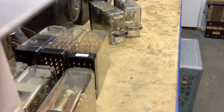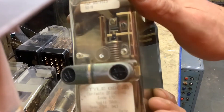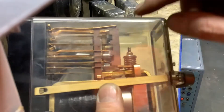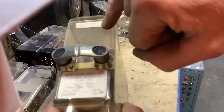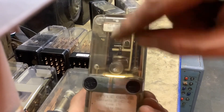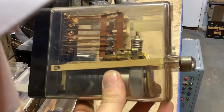Here is the motor drive relay. This is designed to switch high current when driving point motors, and when you stop driving the point motor, the spinning motor becomes a generator producing back EMF. The drive contacts are separated by a lot of plastic — you can see the separators between the two sets of contacts — because both the positive and negative feeds to the motors are cut through this relay. There is also a permanent magnet just to the side that acts as a blowout: any sparks induced by the back EMF are blown out and snubbed by the permanent magnet. That is the motor drive or motor contact relay.